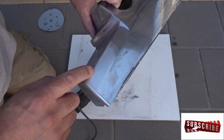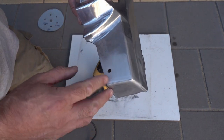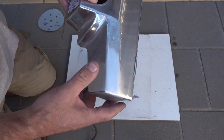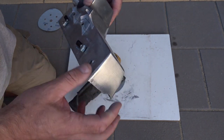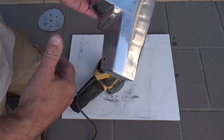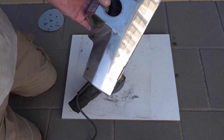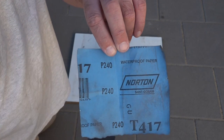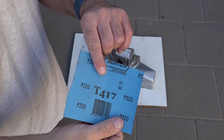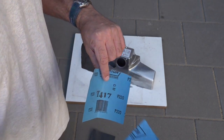As you can see, we've got most of the deep scratches out now. The rest we'll get with some fine wet and dry — that was just 240 grit and an orbital sander, so if they're not that deep, they've come out pretty well. These are just teeth marks, so it's not that bad. What we're going to do now is get some wet and dry and work our way up to around 2,000 to 3,000 grit, then polish it up. We'll start with 240 wet and dry, then go up to 320, then 500, then 1,500, then 2,000.